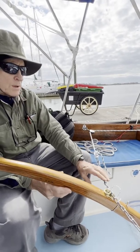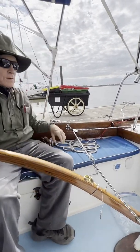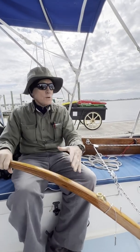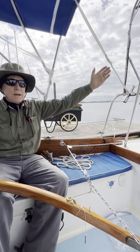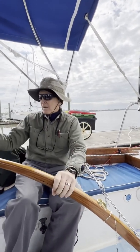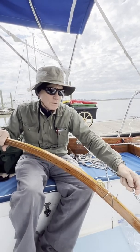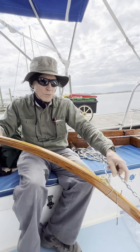Another detail here is the amount of weather helm. The way you operate this is you're normally starting to sail by steering by hand or tiller pilot, not with the wind vane yet. So you get your boat on the course you want to sail and you've got your sails adjusted. You've checked your compass and GPS and you're going the way you want to go. Now you want to put the wind vane on. The first thing you do is turn the wind blade into the wind so it feathers and stands straight up. As soon as it does that, you come back and check your course again — make sure you haven't drifted off course. Then you note, I have to hold the tiller here to stay on course, I have this amount of weather helm. And then you say, I need to not put the chain in the center; I need to put it over here where the tiller is. And if you don't have weather helm, you can put it somewhere near the center probably.